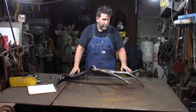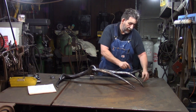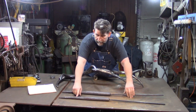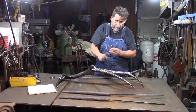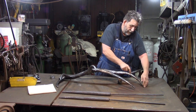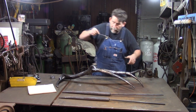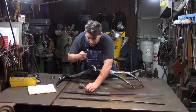Once I get it bent, then I take the tines and I take my measurements and I don't even look at that, okay? I just come up here and I pull me a measurement here where I want it to be, and I got a pile of tines. Like I said, I've got a pile of these tines. This is 1 1/4 inches, this is 1 1/2 inches. I take my, this is going to be kind of awkward because I'm trying to show you, but I come up here and I just lay that on there on the original. Figure out where I remember. I got to keep in line with where my main beam's at, not up here, back here where my main beam's actually running. And I come up here and I just come down here and I make a mark with my Sharpie right there.